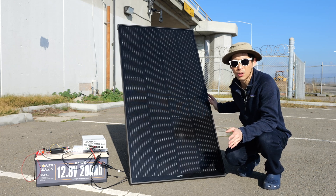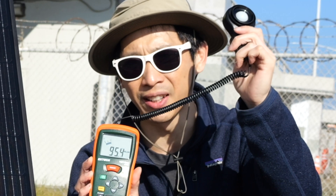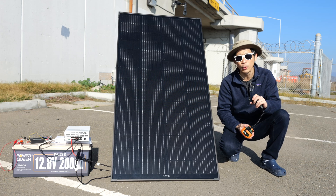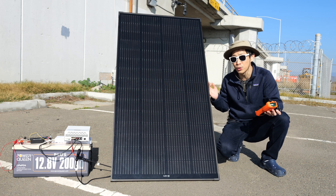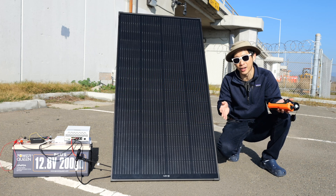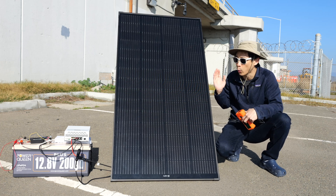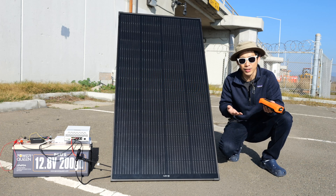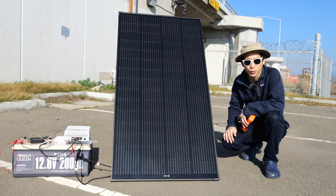This is just to see if I can actually get 200 watts out of this. 20 minutes past noon and I'm getting 180 watts, reading about 95 kilolux — 100 kilolux is about full sun. It does get a little stronger at around 120–125 kilolux in very strong summer sun, so it seems reasonable that it can obtain the full 200 watts. The sun has a spectrum of frequencies including a lot of infrared, and solar panels can absorb infrared light very well. So at least for me, it's not too far a stretch to say this can output 200 watts in full summer sun.